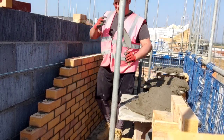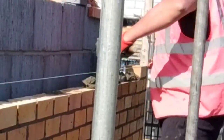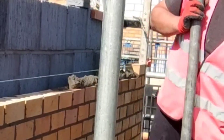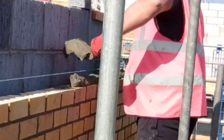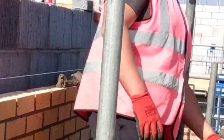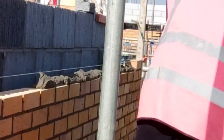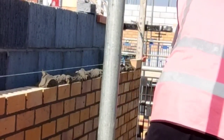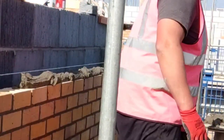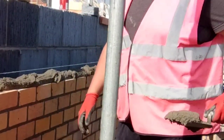I'll be using less of these three profile setups, probably going back to more two profiles, or a three profile setup if we've got the adequate distance to run in, because with the concrete bricks, you need to run on longer flanking at once to let each course go off, stop any sinkage, any bellying. And the mortar has to be a little bit more workable, so it's probably a bit better for pick and dip. So a lot of these bricks, a lot of the days I've been laying traditional, so